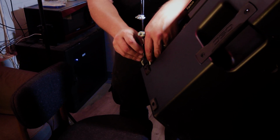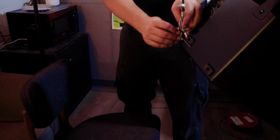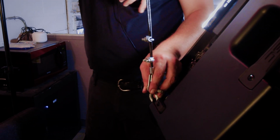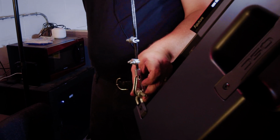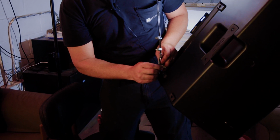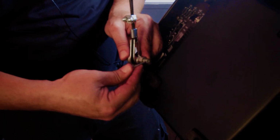And now I've got an angle. Now, if these Crosbys were really any more loose than they are right now, that would just kind of pull straight out. So you need to be real careful with it. On this particular type of shackle, the way to secure my shackle is through a cotter pin, all right?